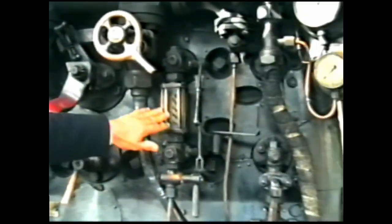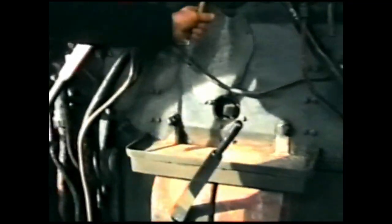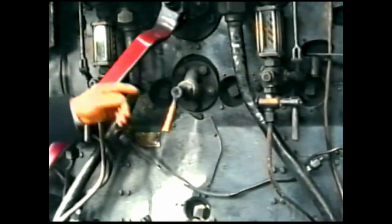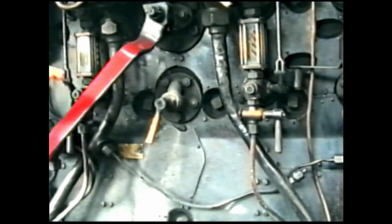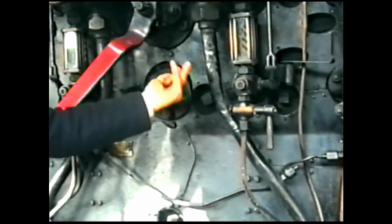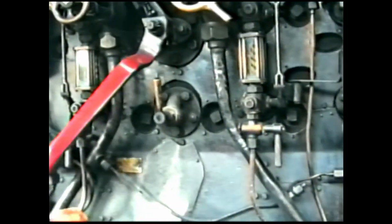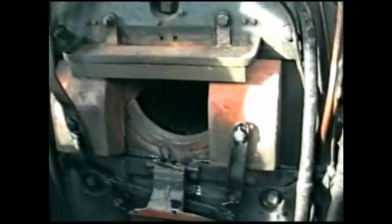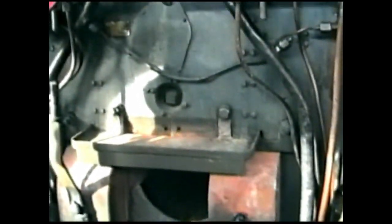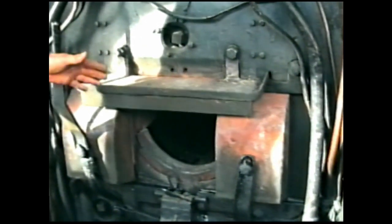This enables us to change the glass when we get to our destination. Moving across further, we come to the lever operating the blower. The blower is a perforated ring in the smokebox, either just above the blast pipe or cast integrally with the chimney. When we open the blower, steam goes through a lot of holes in these rings up through the chimney and draws the fire — pulls the fire through the tubes by creating a vacuum in the firebox. This enables us to increase our steam pressure more quickly, get rid of smoke at the chimney, and also when running through cuttings or into a tunnel, ensure that the fire continues to be drawn through the tubes out of the chimney with no chance of the fire blowing back into the cab.